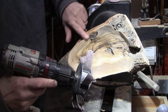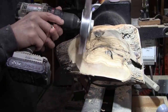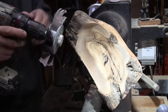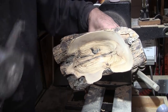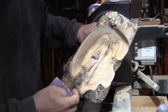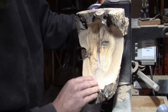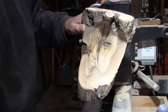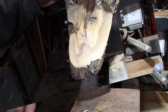What I want to do is soften these edges and I think the sand discs will help go over this bark. This is really at the point where I think I can go and sand this with 220 going this direction, and then make sure these edges are good. I'll go ahead and do all that and we'll come back and get the sanding sealer and shellac on it.